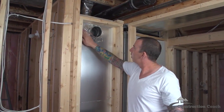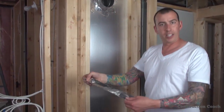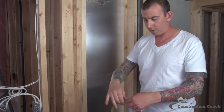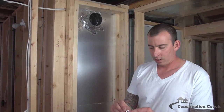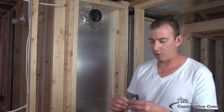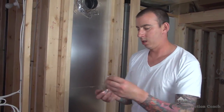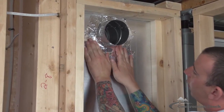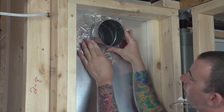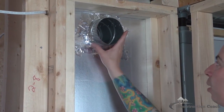When you're doing joint material with ducting or anything like that, it's a good idea to use tin foil tape. Foil tape seals all air gaps which makes your system more efficient. Just pull off the back. Now you can see here I've got all the other pieces all the way around, just ensuring that the seal is nice and tight around the thermal pan to the elbow.